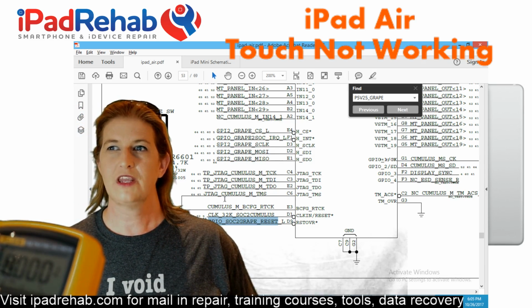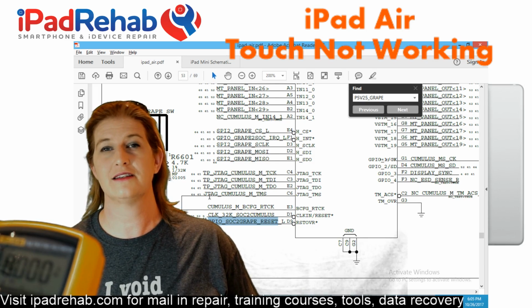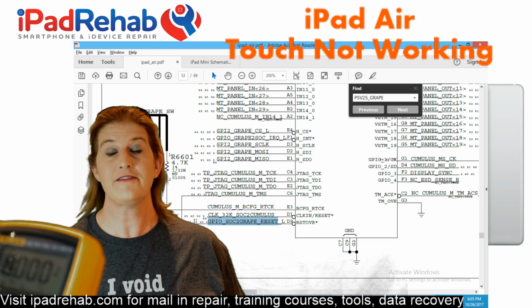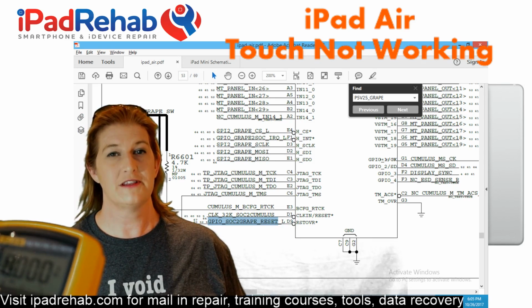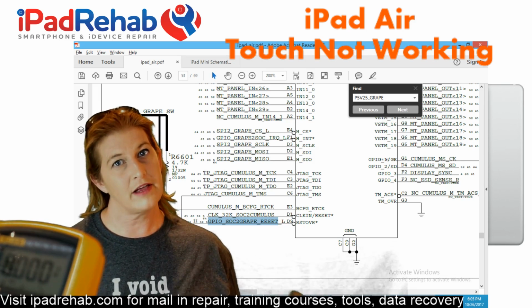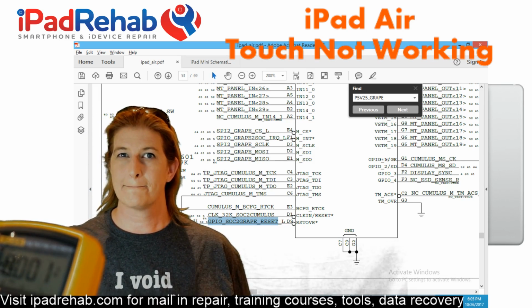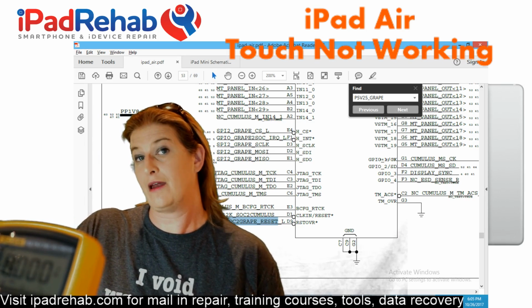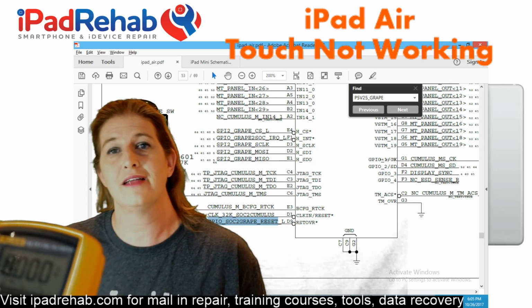So it may be that there's some kind of a timing issue that we definitely didn't think about before. Maybe this PP1V8 grape SW has to be present at a certain time during the boot up sequence that we may not have thought about. Anyway, lots to think about.